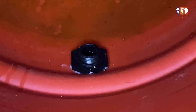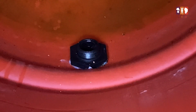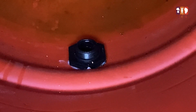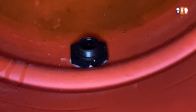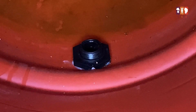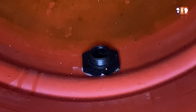Here we have the inside — it's been sitting out while we're waiting for a piece for the downspout. You can see where the interior portion has been attached, and of course we needed to consider where the spigot was going to go, both for how flat it was going to be and to avoid that ridge. If we tried to put the spigot on that ridge, we never would have gotten a nice seal. You can see the caulk on the inside as well. Once we put the interior part on, caulked everything, and put the spigot on, it was kind of ready to go.